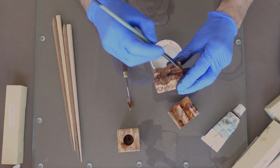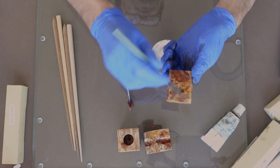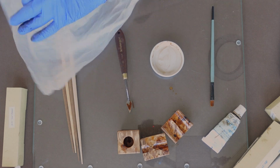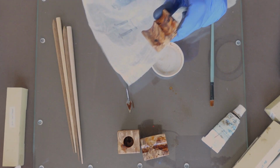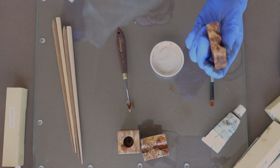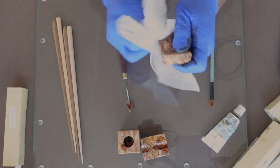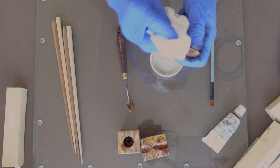Okay. All parts are lacquered, they sucked most of the urushi in, and now it's time to wipe off the surplus urushi. I could leave them for a little longer, even for 10 minutes, but as I said, it sucks the urushi quite fast, and for me it's just a contour layer. So the layer which will reveal all the imperfections and let me resand the surface, and actually after the sanding I will reapply the first layer.